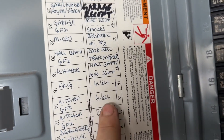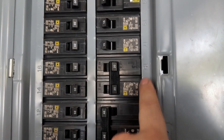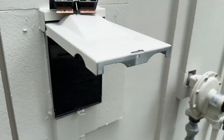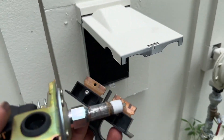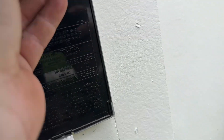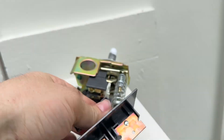Safety first — I'm doing all this work around electricity. The well is breakers 15 and 13. So if I look over here, 15 and 13 are off. If you've got a well and your house is up to code, most likely you're going to have a disconnect, which is one of these things. Your disconnect sits in here like this. What you want to do is two fingers on it, pull it out, and set it up here.